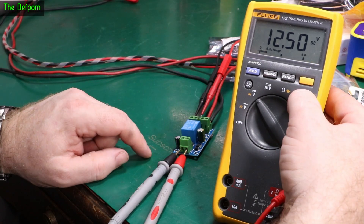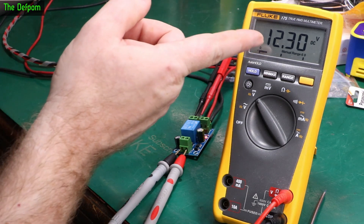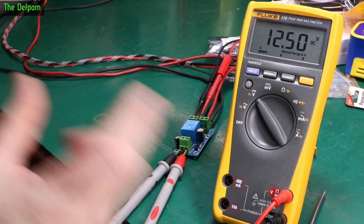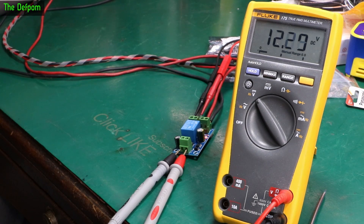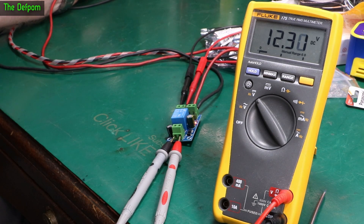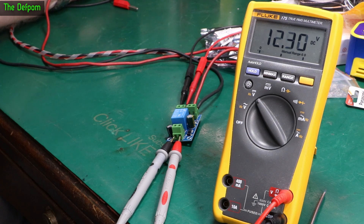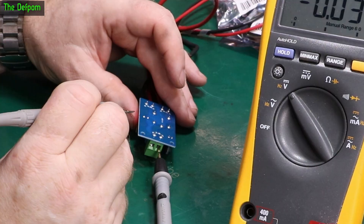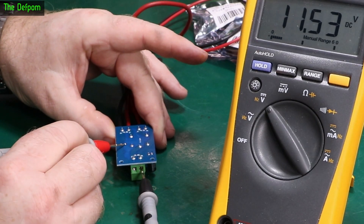I'm not sure there's much of a changeover delay. It does see it drop down — when it's turning on it's almost instant. But when the relay is relaxing I think it's got a capacitor across it which is causing the relay to gradually change off. Turning on is quick, turning off is a bit slower — that's not unusual. Relays sometimes react differently in each direction, as the capacitor discharges then the relay gradually turns off. If I pull the battery supply there's nothing happening as expected, and when I pull that it's going to die completely — so that works as expected.